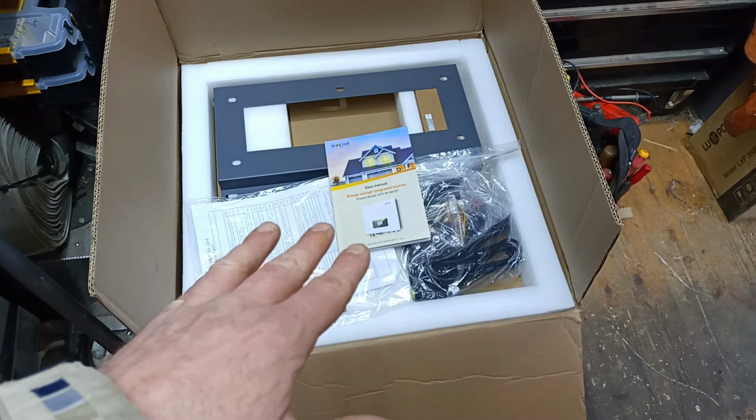The plan was to replace the Gumtree specials and hang the inverter here. It's IP rated, so all of this dust and detritus doesn't really matter. But that level there is where the bus bars are on the inside of the metal workshop. So by the time I poke holes in the wall for the battery cables to come through, the inverter's all the way up in the sky. And it's not very practical.